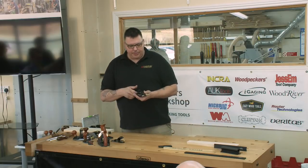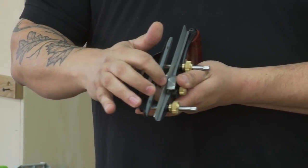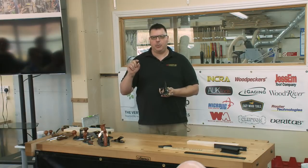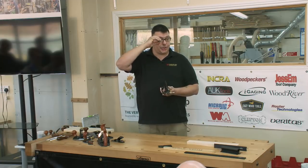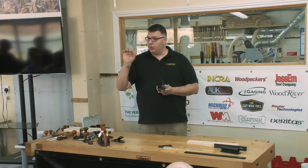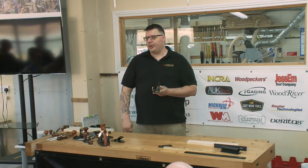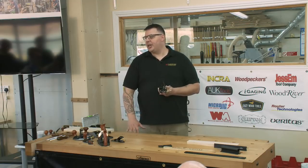So to set this up, the rule of thumb is that the blade width will determine what your offset is. So if you're gonna do a drawer bottom, let's say with 6 mil ply, you're gonna have 6 mil of relish or material that is there. Relish is a term that timber framers use about wood that is on a joint that it's supporting, right? You don't want it too thin at that edge, because then if you put anything heavy in that drawer, it could actually break the wood out, and then you have a bottomless drawer,